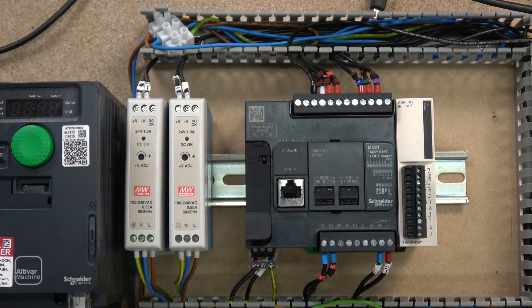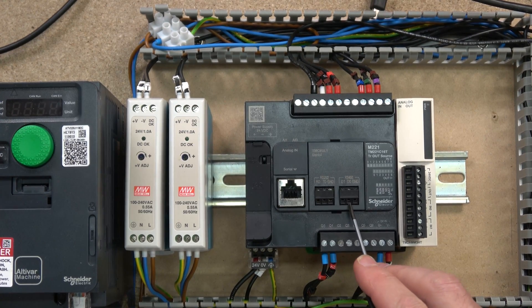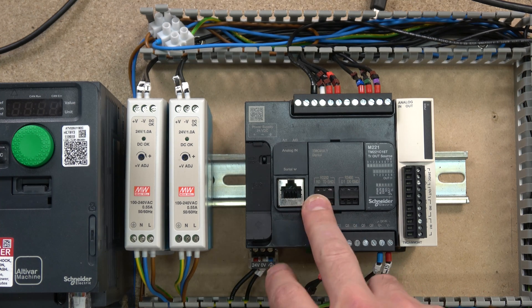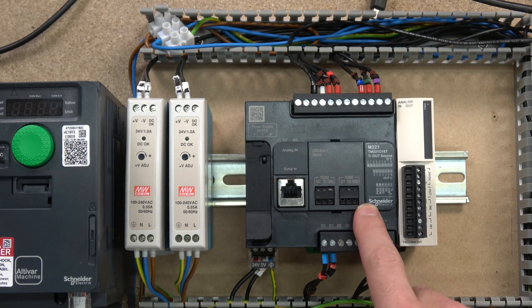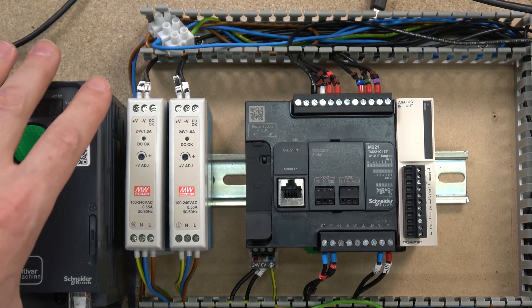Always make sure the power is down whenever you see ESD. As you can see in here, we have two ports — one is RS-232 and the other is RS-485. RS-232 is usually for just one unit, one field device. But if you want to use more devices you will need RS-485, which is what we might use later when adding another drive.